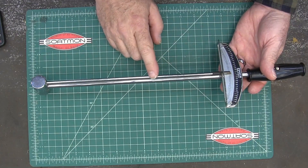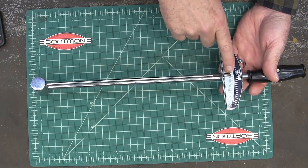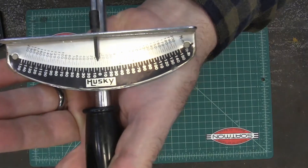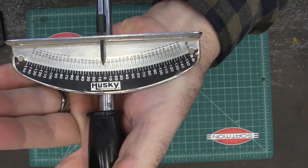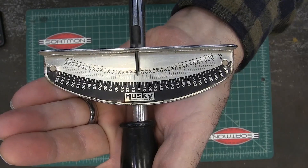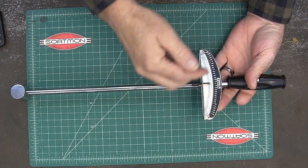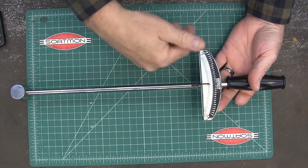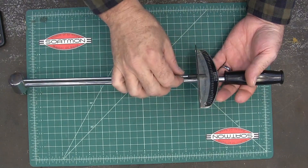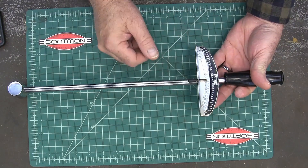While reviewing the video, this Husky wasn't as accurate as I always thought it was, but now that I come back and look at it, you can see right there when I take my finger off of it, the pointer is like at five pounds instead of zero, which would give you the error I saw — about five pounds incorrect on both sides going each way. So I guess I just have to allow for that or somehow get that reset. I'll have to look at that later.